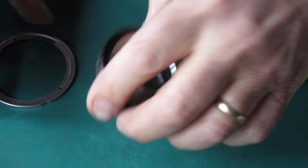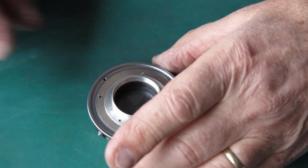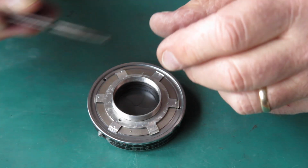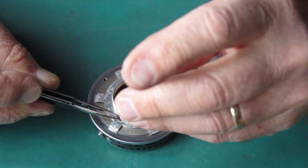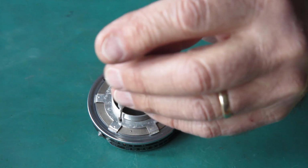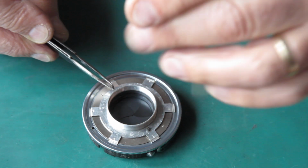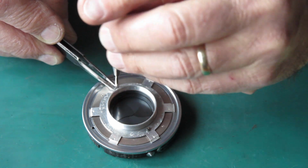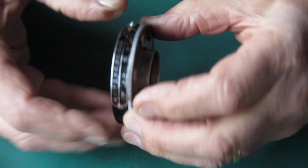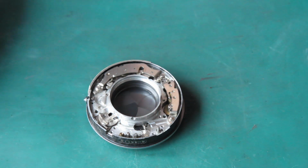And we're done with the aperture. We don't need access to those, so we can put this lever back in place. And this piece. With the mechanism plate installed, the next task is to put back all the control levers that go on the mechanism plate itself. Making sure the diaphragm moves smoothly, making sure that the shutter blades open and close smoothly.